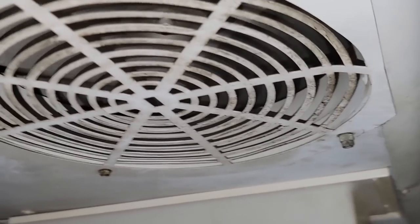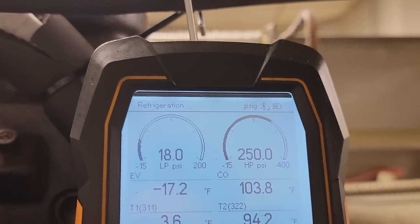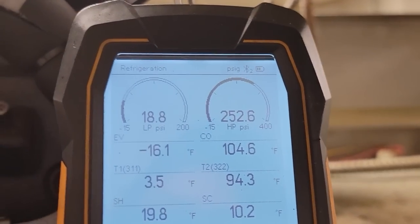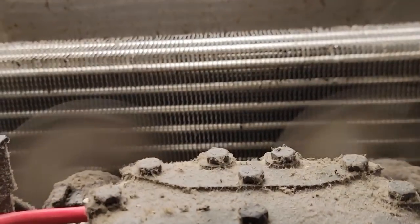Box is at 66 degrees and dropping. Wanted to check if the fans are running — and yes, they are running now, so suction pressure should come up. Suction's starting to come up; that's a good thing. You could only imagine what it would have been when it was completely plugged off like it was, especially since the shroud around the fans is non-existent.